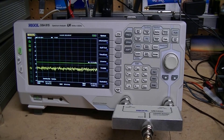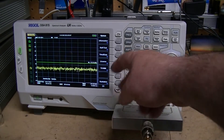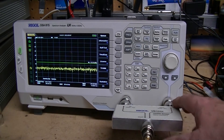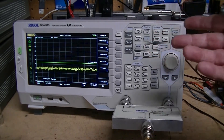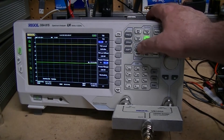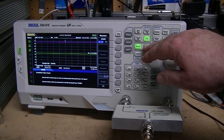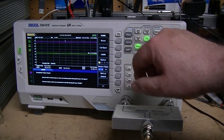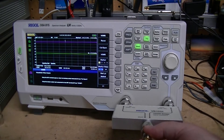What I've got set up here is the spectrum analyzer. This is our VSWR bridge — it's plugged into the tracking generator, which puts out a signal through our device under test and then over to the input on the tracking generator. I have to use some adapters to get this down to SMA size. We're going to zero those out by enabling the VSWR bridge, then going to measuring setup and performing the open calibration. Now we can put our device — the antenna — on.